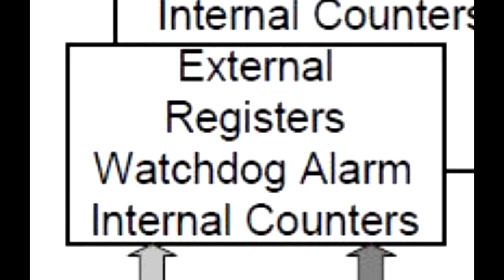The last major function in this chip is the watchdog. If you're not familiar with what those are — it's a function outside of the processor core that counts down, and if it's not reinitialized in time, it can generate either a reset to restart the entire program, or sometimes less dramatically an interrupt to pull the code back into a known good state. It's a very common approach in real-time design where you absolutely must make sure that if the product crashes, it automatically recovers.